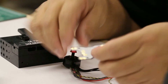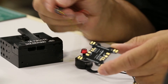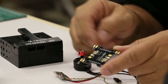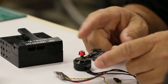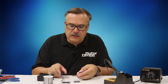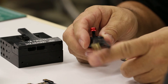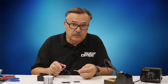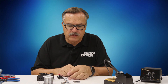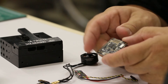The next thing is a power distribution board like this — you're going to be soldering your ESCs to this, and also soldering your power cable or power plug that plugs into your battery. From there, you'll cut these wires relatively short and solder them onto the ESC, which allows you to clean up and get rid of extra wires so you don't have extra weight on the quad. You also have to learn how to shrink wrap that once you're done.